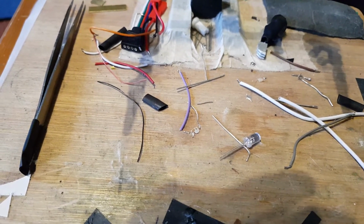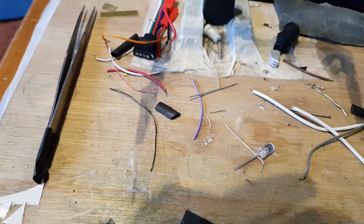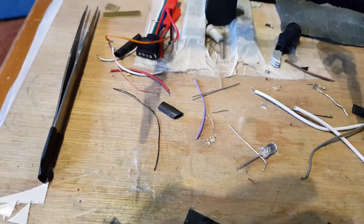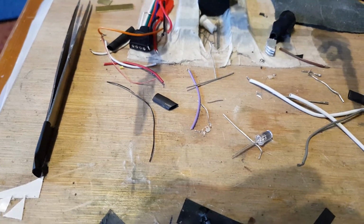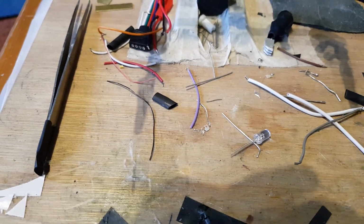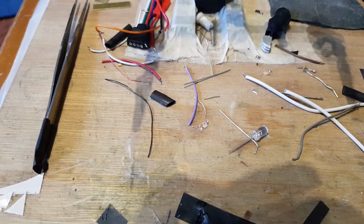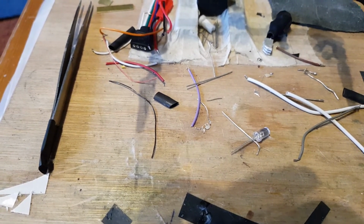If you're not very confident at drawing solder across from one pad to another, then you could use that on that pad for instance, and you're only going to need a tiny little dab of solder on both pads. The other thing you can do is bridge the two earths together on an auxiliary and power button as they share the same ground, so you can bridge the two together from one button to another if they're in close proximity to each other.